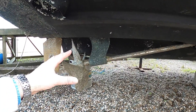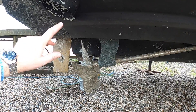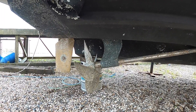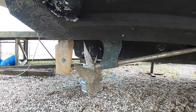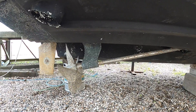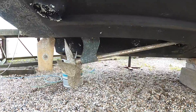There's a lot of drag with this system — you've got the prop shaft itself, you've got the P bracket, you've got the rudder all being dragged through the water — so that's reducing efficiency, using more fuel and dropping the speed back a little bit. Because the propellers are fixed they only point in one direction, which is straight back, so all the steering is done by the rudders and it's a little bit less dynamic. But it's a very good system, very well proven, and easy to maintain wherever you are in the world.